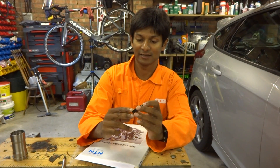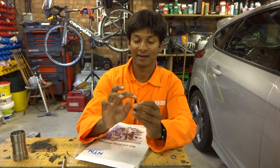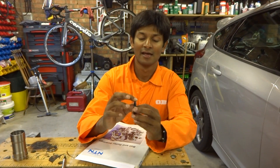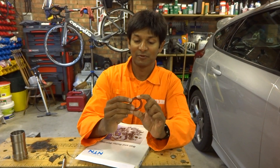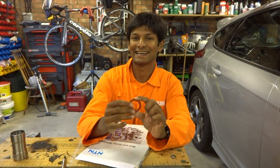The other factor is the smoothness of the running surface inside. Although these surfaces look smooth to the eye, at a microscopic level they look like a mountain range. The finer the tolerances — the higher the class grade, such as class 2 — the flatter that surface becomes. Class 2 bearings also have tighter run-out, which measures how eccentric the movement is. Zero run-out means perfectly circular orbit about the centre line; excessive run-out makes the orbit look slightly eccentric — more like an egg shape rather than a circle.